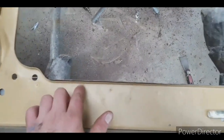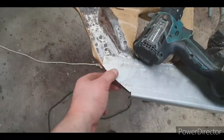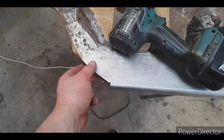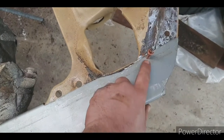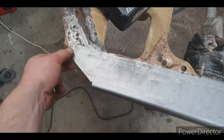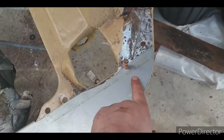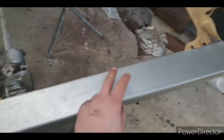See the run out that I'm talking about with the bender? Really need to go adjust it. At this point, now that you're getting closer to the patch being fitted, you want to drill a hole here, chuck a cleco in, another hole here, chuck a cleco in. Otherwise, if you start cutting and keep fitting it up, expecting it to be in the same spot, it won't be.